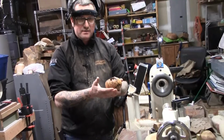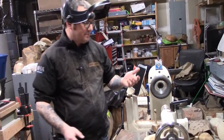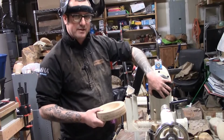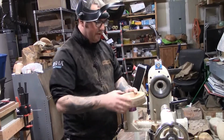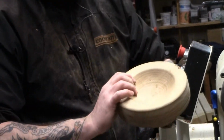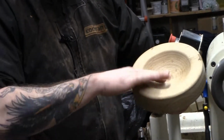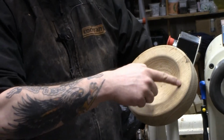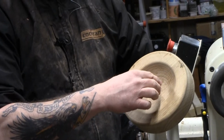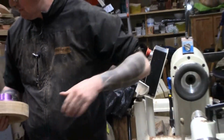Most of my hollow forms that are solid, I use the vacuum chuck, but often without vacuum, because a lot of times there is a crack or void or something else that won't hold vacuum, but it makes a good round surface just to hold the end of a vessel. But before I bought those, I had made this glue block, I guess, but I didn't use it as a glue block, I used it as a jam chuck, a friction chuck, and just scooped out the inside so I'd have room for the mouth to sit and the vessel would ride on the shoulder here without the end touching anything. And that worked pretty good for a while, but I really like these vacuum chucks.